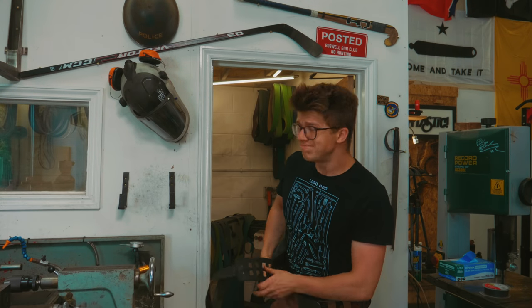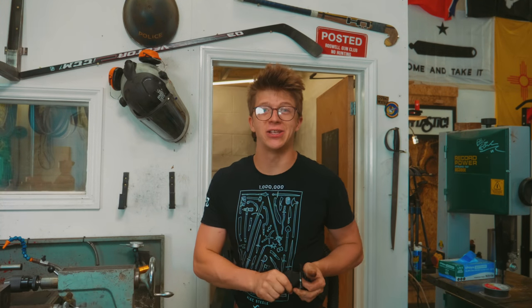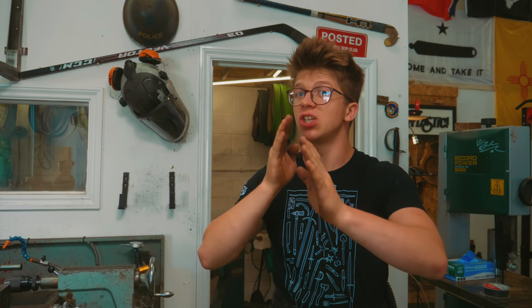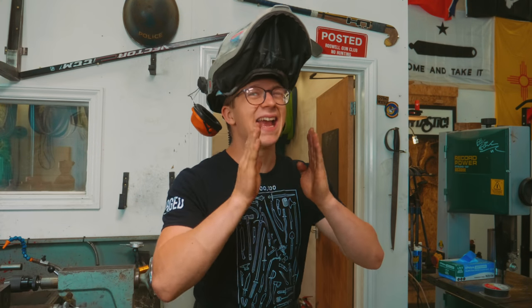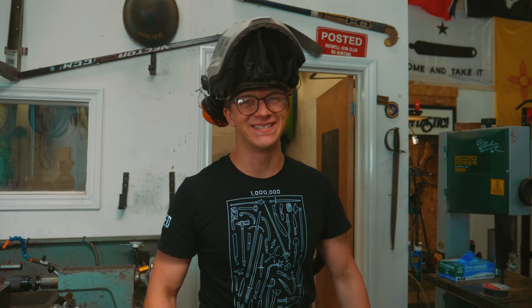And so with that tempered, now comes the really exciting part of taking down a huge amount of meat off of this. It is straight, but kind of like globally straight. There are some wiggles in it, so we're gonna have to pay attention to grinding it in to the final straightness, and we also have to pay attention to the thicknesses that James Elmsley has very kindly told me about for a correct feeling falchion. Long and short of it is it's thin. It is a thin, thin blade. Thinner than I even thought. Let's get to it.